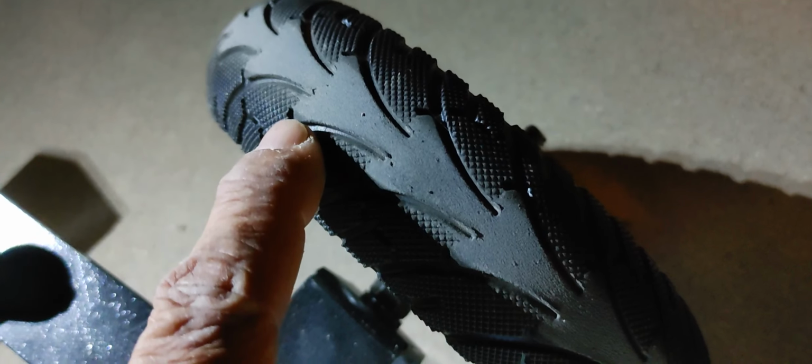positive control. And if you can see the wheels, they're wearing out nice and even at the center. Look at that. You can see just a little bit of a darker gray here from the rubber, but this is an indication that the wheel is true as it's spinning on both sides. So there's no excessive wear on either side, as opposed to this wheel that was wearing a little too much on this side right here. And this tends to rub, and I lose power, because the motors are trying to push this while the wheel is kind of trying to skid, because something happened here with the angles, the way I did this, and I talk about that in another video, so I'm not going to go too much into that detail here.